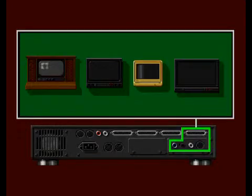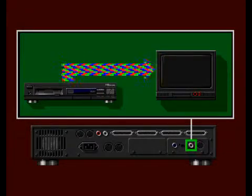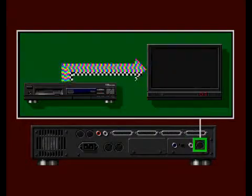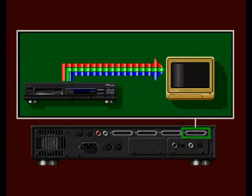There are four different types of video signals that you can send to a television set, VCR, or monitor. They are: RF for radio frequency signals, which are compatible with almost all television sets, like the signals from an antenna or cable TV; composite video signals, which are higher quality and compatible with many late-model television sets and VCRs; S-type video signals, which give a still better picture and are compatible with the most advanced television sets and VCRs — S stands for super; and RGB video signals, which can be sent to a monitor — RGB stands for red, green, blue.